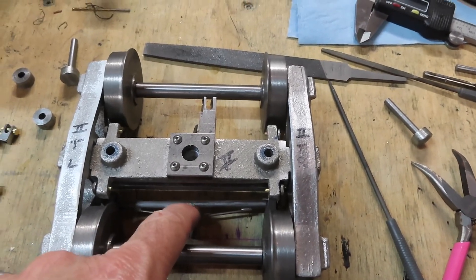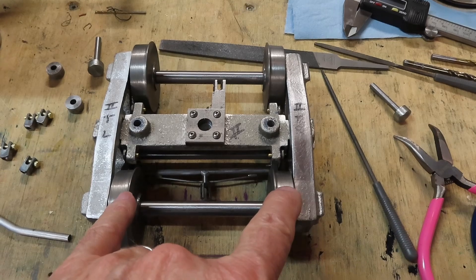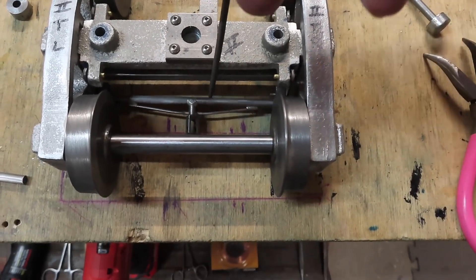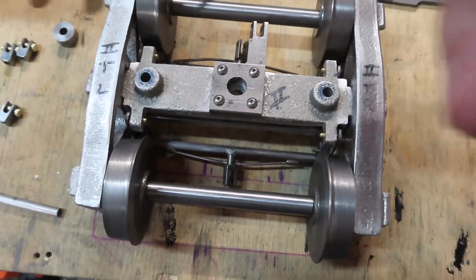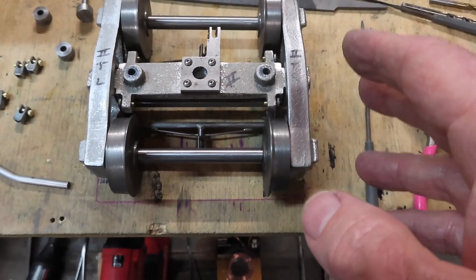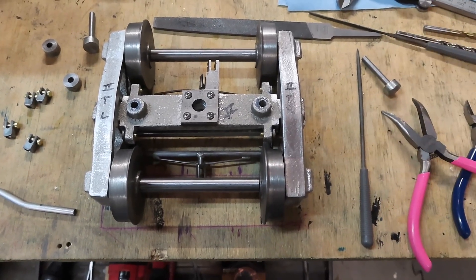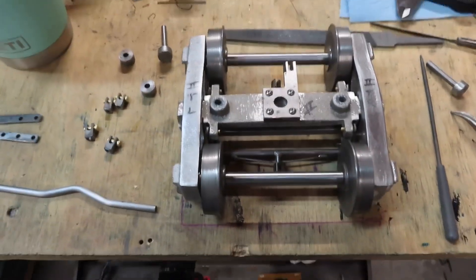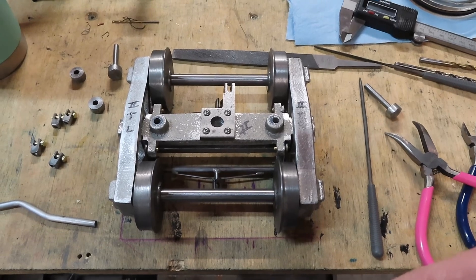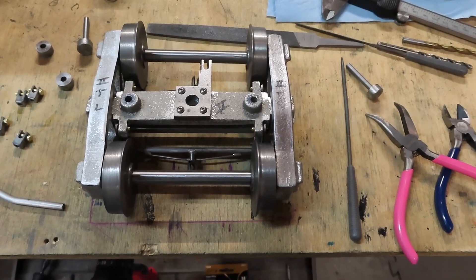Day two of test fitting the trucks. The cool thing is it generally looks good. I've checked the back spacing and the wheel tread spacing — everything looks good and the geometry is fine. The brakes, when I lift the brake shoe assemblies up into place, they do come into the right spots on the wheels. It is a little tight in here, but that's actually good news because I can file down and make a little extra space where needed. Don't get freaked out by a little setback — if everything doesn't fall into place perfectly it just means some light fitting work is needed.